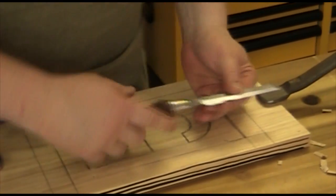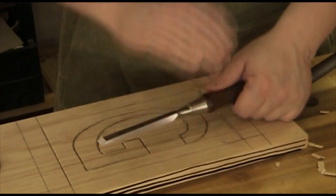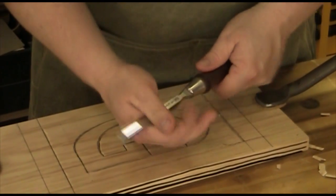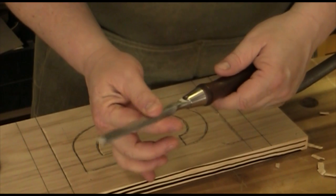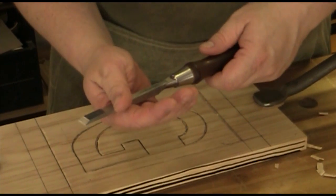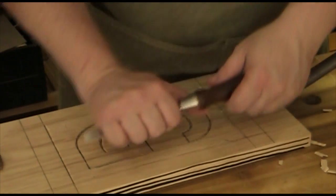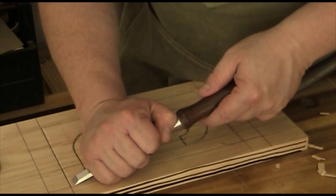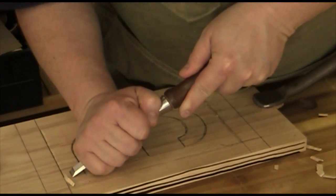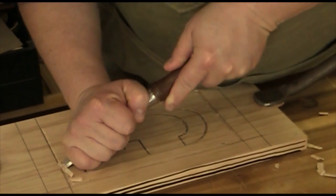Now you're going to notice me switch to the bottom. Please notice, I'm just going to switch hands. This is something when you're working with hand tools, you need to get used to being somewhat ambidextrous. This is not an overly complex thing. It's not like writing letters or writing your signature. All you're doing is holding and pushing, maybe a little direction. So you can try both hands. Just lock it down, lift it up to about 30 degrees, and kind of wiggle it towards the base, or push towards the base. Now I want you to notice what's happening here.